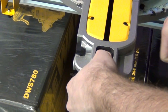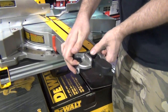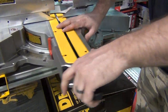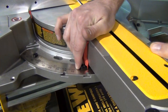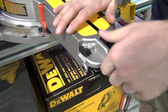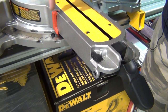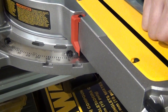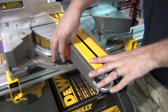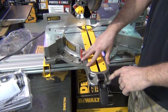There are several other features which I really like. The normal miter saw — you push down and you slide back and forth, and you've got detents. Detent override lets you pull that up and push the button down, and now there are no more detents. The value is, let's say you need to be just a quarter of a degree off zero — now you can lock it down easily without any issues. Without that, the saw always wants to go back into the detent and is constantly fighting you when you lock it down. Those of you that have done just a quarter degree off any detent know how that feels. Bosch has that and so does DeWalt — it's a really good feature.